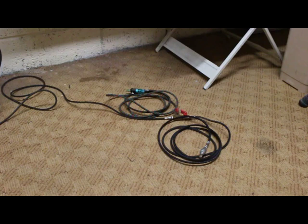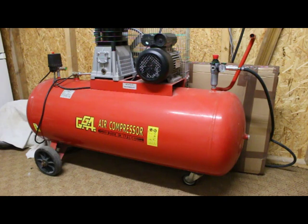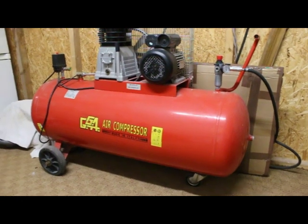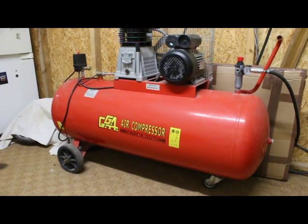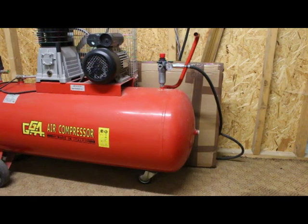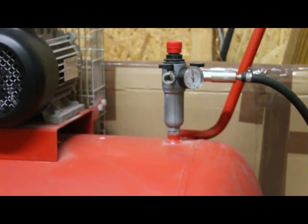I'll now show you the compressor that I use when I'm clear coating any of the work that I've done. This third compressor is a 200 liter, three horsepower, two cylinder, belt driven, oil filled compressor — it holds a fair bit of air so I can use this when I'm clear coating. On the left hand side, the little black box — you can see behind that is the gauge which shows the pressure inside the tank. Just here where the handle is, there's a gauge that we can alter to change the pressure we're going to use.